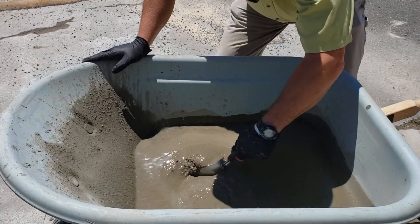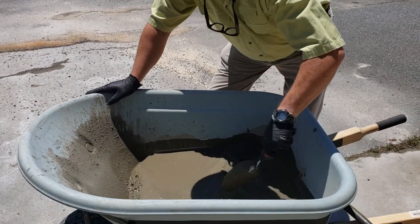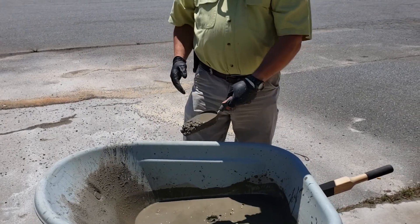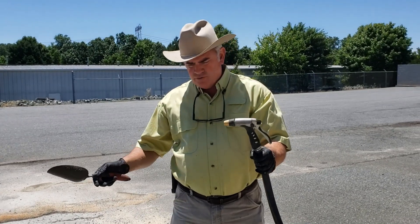Now let's examine the results of our mix. That's so wet, it's not even concrete. Now this is an exaggeration, but not far from what I've seen in real life — I've seen footings poured close to this wet. The concrete at this point is segregated, meaning there's so much water it's just separating. The key to our example was I added water through a water hose, which is indiscriminate — it just goes when you pull the trigger. It's not metered water. We had about 25 seconds worth of water, and you see the results.